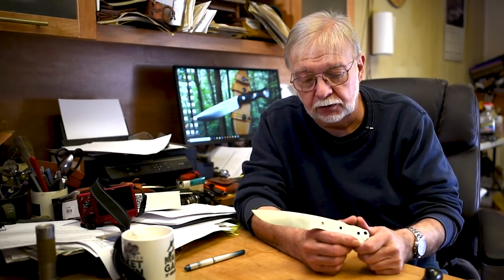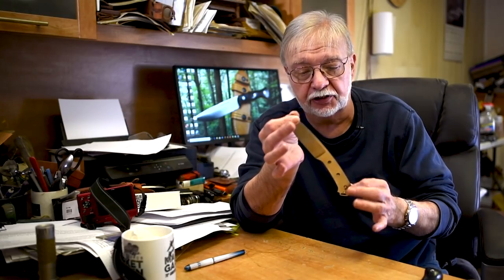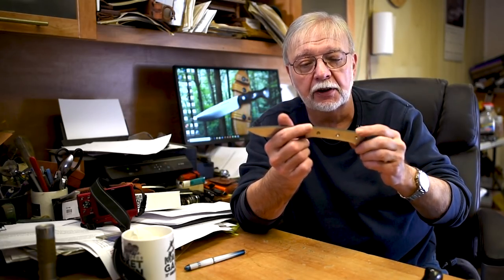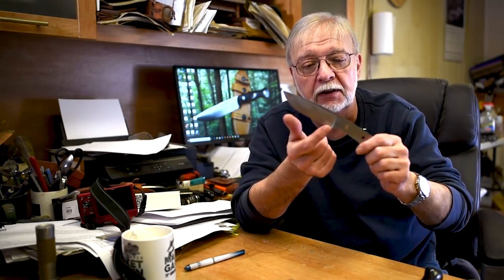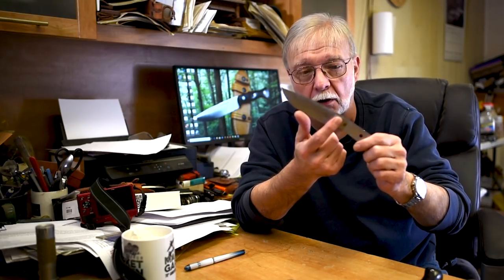Let's talk about the steps we use in completing a knife. We start with modern technology first, so you've got the knife itself — the blade. We've already done the flat grind, so we have this shiny blank. This is the finish you're going to receive it in, with the surface grind marks on it. The first step is to pre-polish part of the blade before assembly — specifically right in front of the handle, which we call the ricasso.